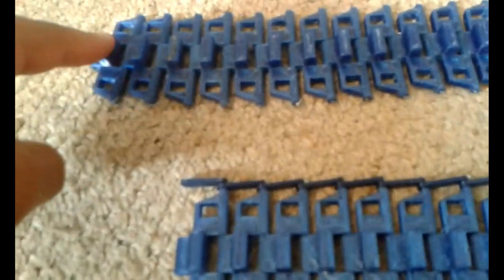I've had to redesign my track slightly. Originally it was going to have bolts that go through, but the tracks bent because of the print bed not being level and I couldn't do that, so I used one millimeter wire that goes all the way through. The problem with that is when the tank goes to turn it's very very bendy, which causes the tracks to not align with the gear and it comes off. So I've now 3D printed loads of these tiny pieces — straight — and printing a hundred of these little pieces takes three hours, whereas printing 10 of the original pieces also takes three hours. It's a lot more rigid, as you can see there's very little flex in this one, whereas the other one is very flexible.